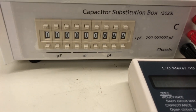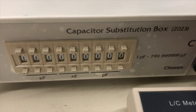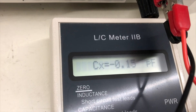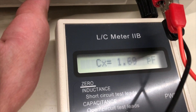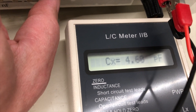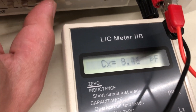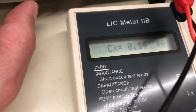The box is set to zero and we can see about 36pF of stray capacitance. You could argue why bother with the last digit or two, but they're still useful for incremental changes. Let's zero that out — now we're seeing around zero and I'll start incrementing the 1pF digit. One, two — looks like the strays change a bit — three, well at least it's going monotonically — four, five, six, seven, eight, nine, back to zero. The LSD is a little bit wonky.